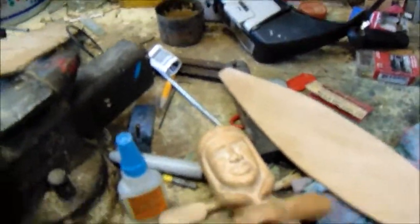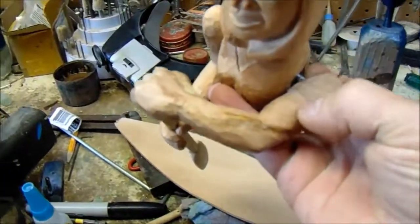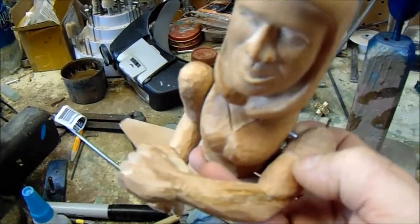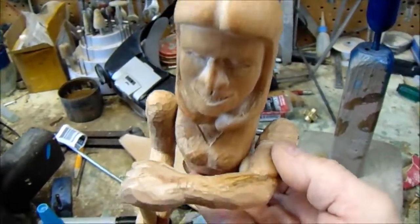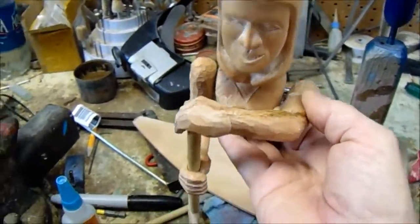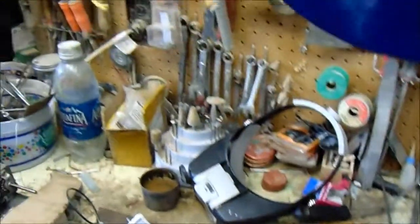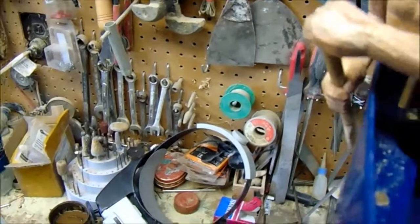When it comes to the figures, it's a little tricky figuring out the shape of the arm. If you're going to carve them, I highly suggest you see how they fit first before you carve, because you might have to make adjustments. You don't want to spend all that time carving if it's not even going to fit. So try to fit everything up before you carve anything. These figures just sit in here like this, and I've got a quarter-inch dowel.